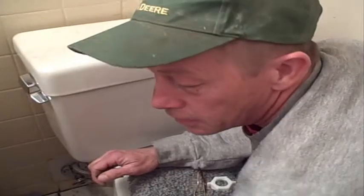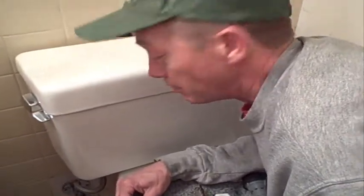Now here's what I want you to do after all is said and done — you've tested it, it worked. Get the lid back on, make sure you've got it on there right. Empty the bucket out and get it under here, or get a sponge — put a little bucket under there and see if you got any drip drips in it tomorrow. If you don't see anything spraying out, odds are you did it right. If you see a little drip drip, it's probably coming from where you put the whole thing into the toilet. Congratulations — you changed your own toilet fill valve. You should be proud of yourself. Y'all take care now, you can do it.